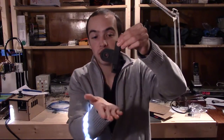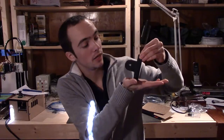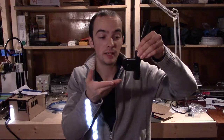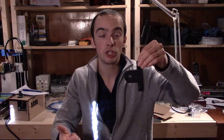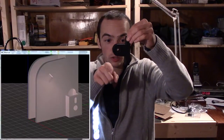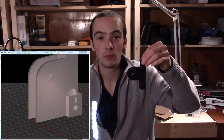So first of all is this big overhanging piece, okay? I'll get to it later, but I decided to print this piece just standing up just like that, okay? And anyways, there's a massive overhang occurring here, and this is totally impossible to be printed. So to fix that, either you use support materials, which I haven't experienced yet. I'll have to test that out in the future, but I didn't want to do it because I didn't know how it works, and I don't know how well it works. So I just extended this whole part all the way to the bottom, and I just printed all the way from the bottom, a nice solid piece. Hopefully it'll give it also some more integrity. Unless, of course, I use it the way I'm supposed to and untighten it before I torque it.